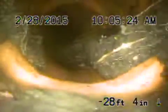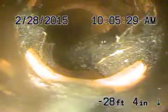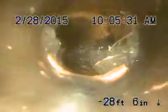This looks like it's all in very good condition. Now over here, this is the six-inch to four-inch connection — you can see there's some heavy roots coming in here. That's five feet deep at the sidewalk. Coming back from here, it goes to a four-inch clay pipe.